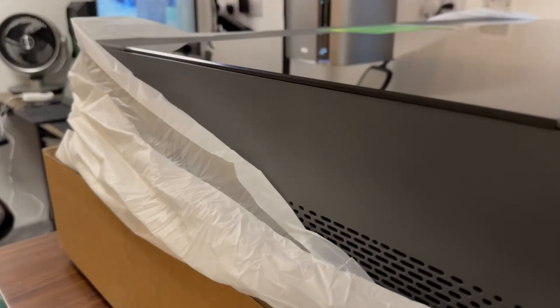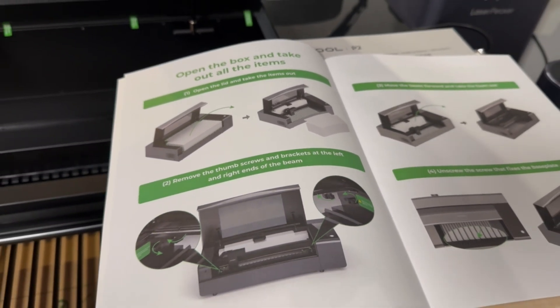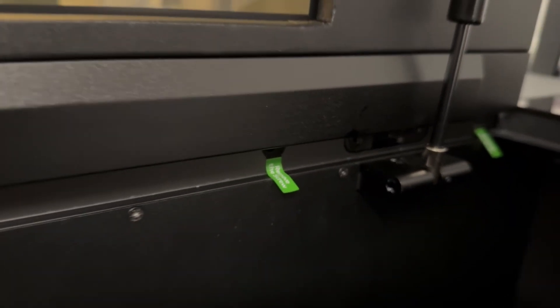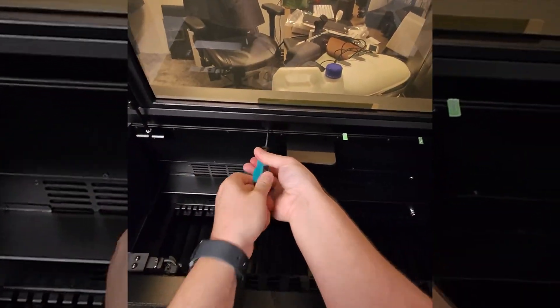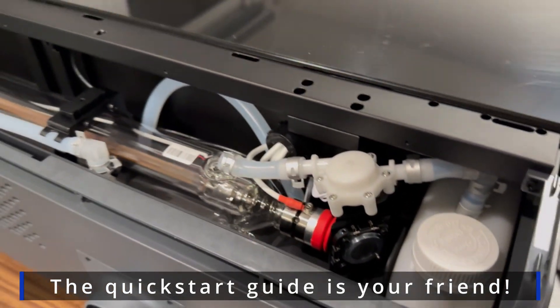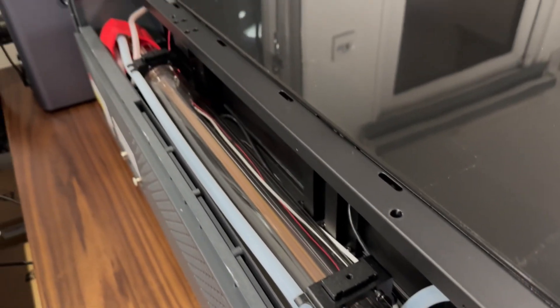Once you've got everything out of the engraver, it's time to get started with the setup and if you've made it this far, the setup's actually quite simple. I think the hardest part of this whole process is actually lifting the P2 up to take the big box from underneath it. Following the quick start guide, you'll see you need to remove a couple of tabs and screws which are just there to help the laser engraver in transit. With those taken out, you'll see these little green tabs that indicate screws to remove — you need to take these out to remove the back plate. With those screws out, the back plate just pops off revealing the laser tubing, and it's at this point you want to inspect that glass tubing just to ensure there's no visible signs of any damage, anything like cracks or little dinks in that tubing.